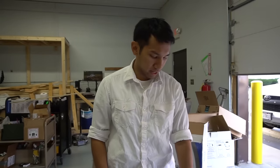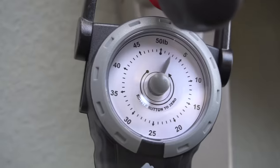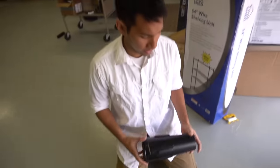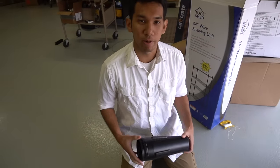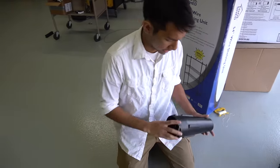So the next goal would be to try various configurations. Either we're going to remove the second stage of the compressor, or maybe try this nozzle first. We'll try the nozzle first, see what that does. Maybe we'll lose a couple pounds of thrust. Maybe we'll gain it. I doubt we're going to gain anything. But let's try that. Okay, so that actually looked kind of worse. It looked like about 2.5 pounds of thrust that time. Let's put in the second reducer and see how much worse this gets.